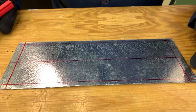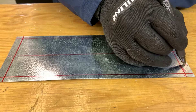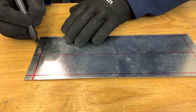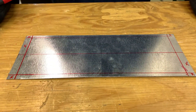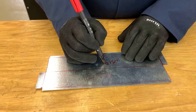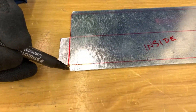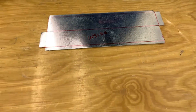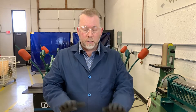I've laid out my pattern, but I also need to cut some pieces out, so I'm going to shade them in with my marker or just add an X. I want to get rid of this piece, this piece, and this piece. On the other side I'll do the opposite. I've also taken about a 30-degree angle off of each corner — about an eighth of an inch — and that will make it just a little easier when we go to fold.